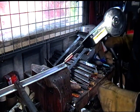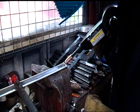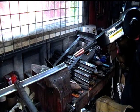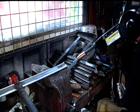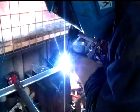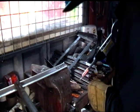See, basically that just looks like an absolute mess, and there's nothing which looks like the aluminium is trying to flow in any sort of way. To me, it looks like there's no shield gas on there. Now, I've tried it with low gas, I've tried it with high flow of gas, and doesn't seem to make any difference. We can try the different angles. It's basically the same all the time.